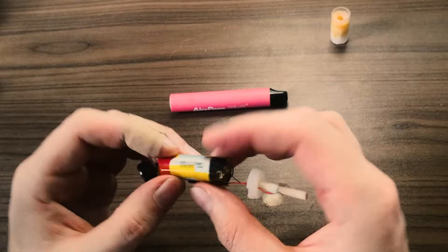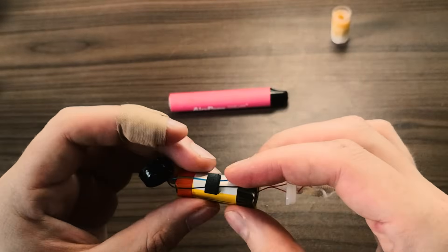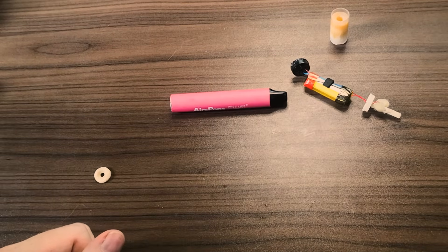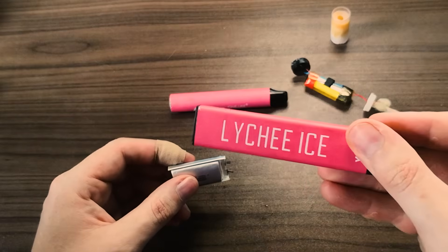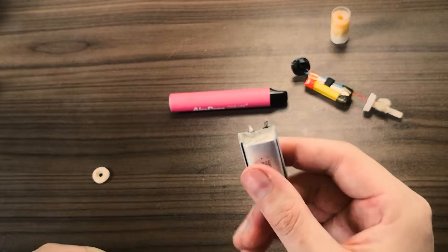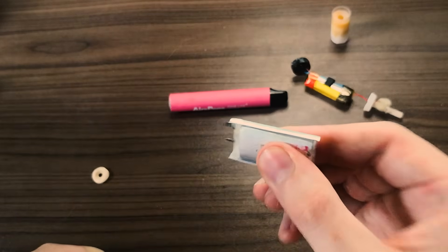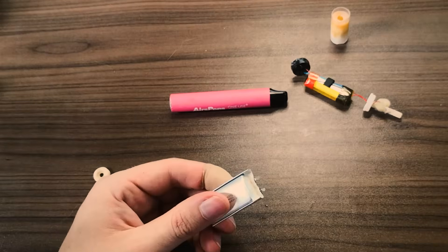This one is completely fine — there's no swelling, no charring that I can see, and the insulation's all intact. I'm happy with the way this one looks. Over here is a battery that is not looking so good. It's a rectangular one from a vape of the same model as this guy over here. Unfortunately, it's got quite a bit of sponginess to it — it feels like there's some gas building up inside there. This is probably good for another 20 cycles, but I would absolutely not risk it. Lithium batteries are a huge fire hazard, and so we need to dispose of this ethically and sustainably.